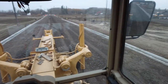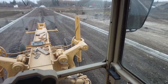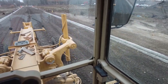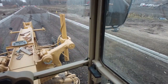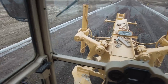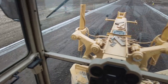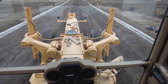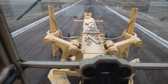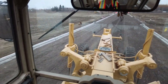Cut the other one, but it was cut in two passes as well. And so both quarter crowns are on grade, so make sure you don't disturb that quarter crown mark. Don't cut on it anymore or add to it. Now I'm just adding to the crown here a little bit because I just had a feeling it was gonna shoot a little bit low. Hopefully that'll do it.